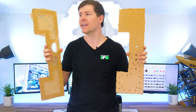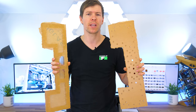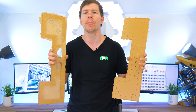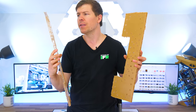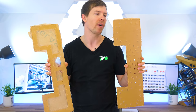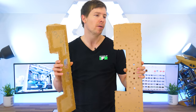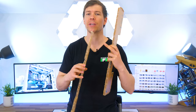We've got the top and the bottom piece of the distro all milled out now. The only thing that went wrong during the process was that the O-ring channel is slightly out — this is because our CNC machine is only a hobby machine, so during the tool change it might have been bumped a tiny bit. But the O-ring being slightly out does not matter; this is still going to work perfectly fine. Now that we have our two pieces, we can make these edges a bit smoother, tap the holes, get the threading in there, and get this all up and running. Let's go ahead and start on the M5 tapping of the screw holes.